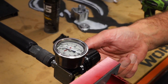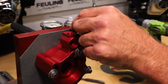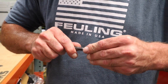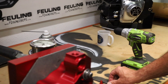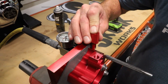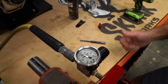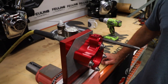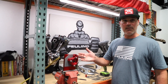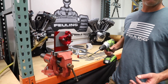Excellent seat and seal, but the full pop-off pressure is a little too high. So we're going to back the pressure off, pull the spring out, and work the spring just slightly. Remember, a brand new spring is always going to set just a little bit after it goes through some heat cycles — so I don't mind setting these up at say 65 psi out of the gate, knowing it's going to come down a little after it sees some cycles. This pump is pretty much ready to go — it's seated and sealing at 40 psi. If the valve wasn't seating and sealing and it was leaking, that's when you want to take the reamer and just touch up that seat to re-square it off and then start over.